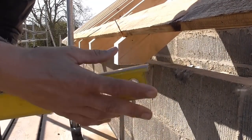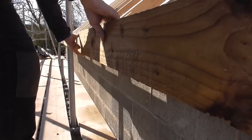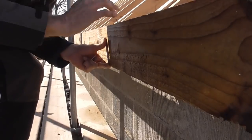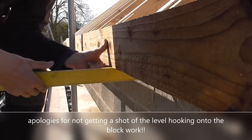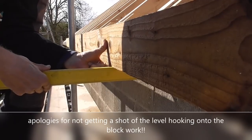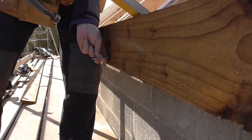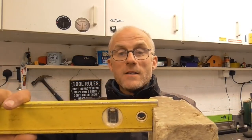As I explained, here's the level, here's the little nick in the end, and simply all I do is get this into position. So hopefully you can see that I basically — that lip's on top of the blockwork and then all I literally do is lift it up or down until it's in the right place. I'll clamp my leg against it — it enables me to just put a pin in. Obviously you can see in the footage that I didn't get the camera in exactly the right place, so you couldn't see me hooking this level over the blockwork. But just a quick demonstration — basically if this was the blockwork, I would just hook that level over the top of it like that and read it across the level to get my sub-fascia in the right place.